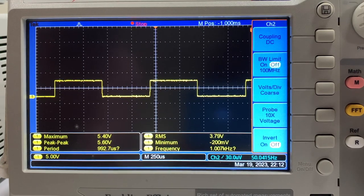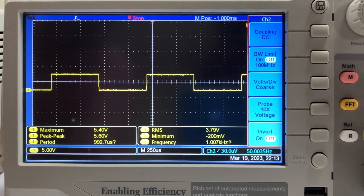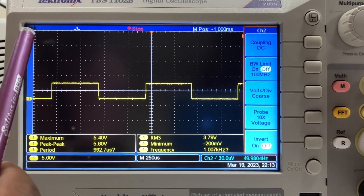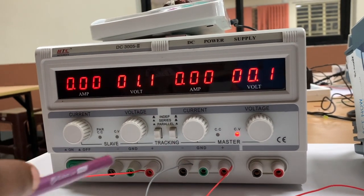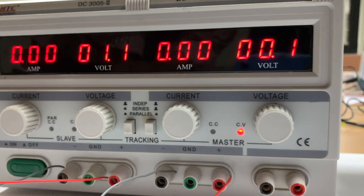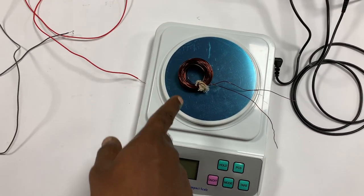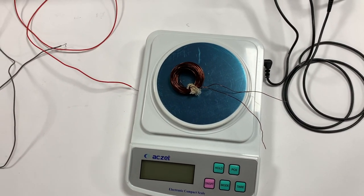So that's how you use an oscilloscope — you can visualize voltage signals and display two voltage signals at one point in time. I want you to connect one channel of the DC supply unit to one channel of the oscilloscope, change the voltage, and visualize the change. Now, coming back to the DC supply unit: it has two channels, and I've been using Channel 2 in constant voltage mode. To trigger constant current mode, we need to connect it across something with a low resistance, so I'm using a copper coil. The copper coil is normally enamel-coated, meaning it is insulated.